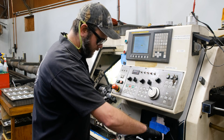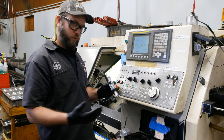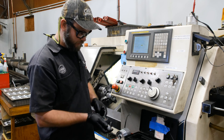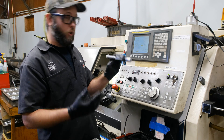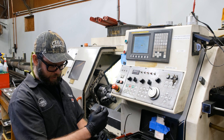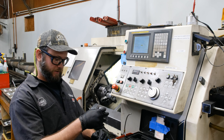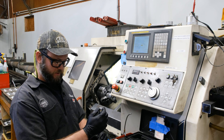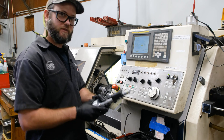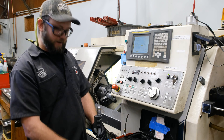We have metrology tools to help us measure it. This shop pretty much exclusively uses Mitutoyo — they're from Japan, very high quality measuring tools. This is known as a digital hole micrometer, or digital hole test micrometer. You put it in here; it has three anvils. You clickety-click, and the little clicky wheel makes it so everyone measures with the same amount of force — a very consistent way to get your dimension. We'll see this one's in tolerance — boom! It's one tenth out of nominal.